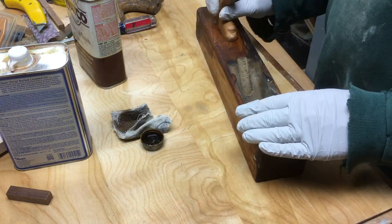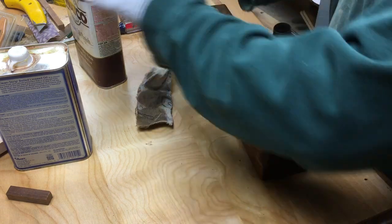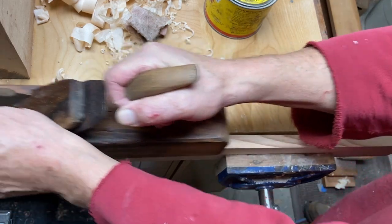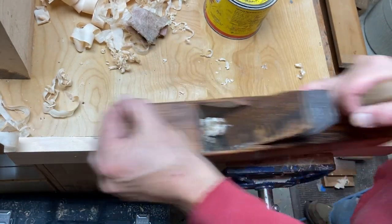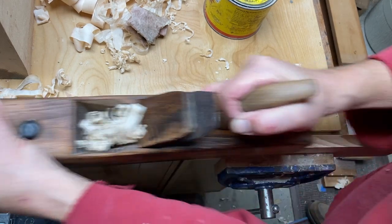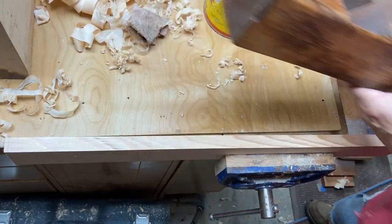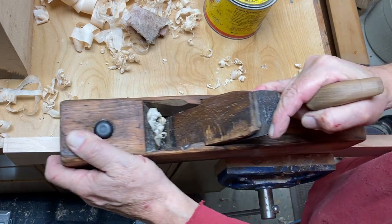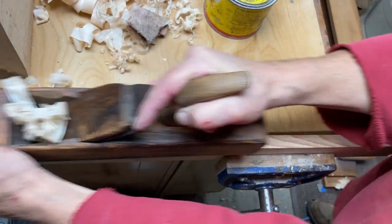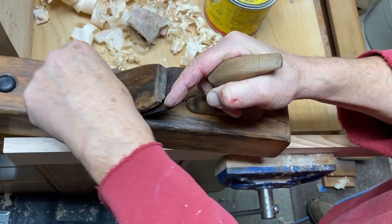You can see how you just tip it in and push it down. After a little clean-up, I think it looks pretty nice. Now that I had sharpened it, here I am just testing it out. You can see it's taking off very fine, very thin shavings — for a few dollars and a chunk of old wood that's over a hundred years old, I am very impressed with how well this jack plane works. This is a Scioto Works 15 — it's 15 inches long. Look at those shavings, they're just perfect. Sharpness obviously matters, and the heft of the plane obviously matters.